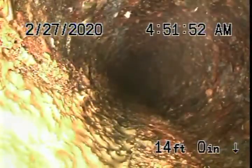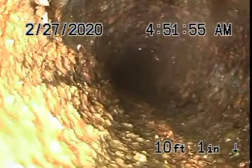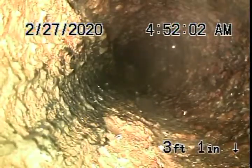There's a section of ABS plastic here. Whatever ABS plastic there is looks good, but then it comes back to the cast-iron which is obviously really old and probably at the end of its life. You can see a lot of sludge in the line — the cast-iron part has really had its day.